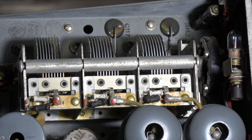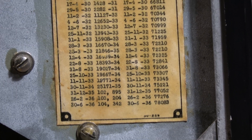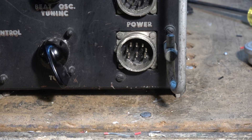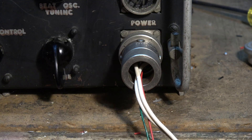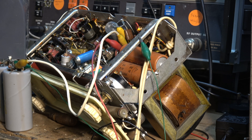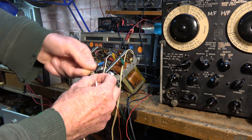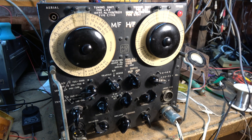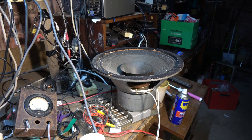These were manufactured by AWA — Amalgamated Wireless Australia — for use in aircraft during the Second World War. I've got one of the rare power plugs designed for these sets. I'm getting 250 volts HT from an old mantle radio, and 12 volts from a lithium cell. It's only designed to run headphones, but I have got it patched into a speaker. I think it's quite sensitive, so it should work okay.